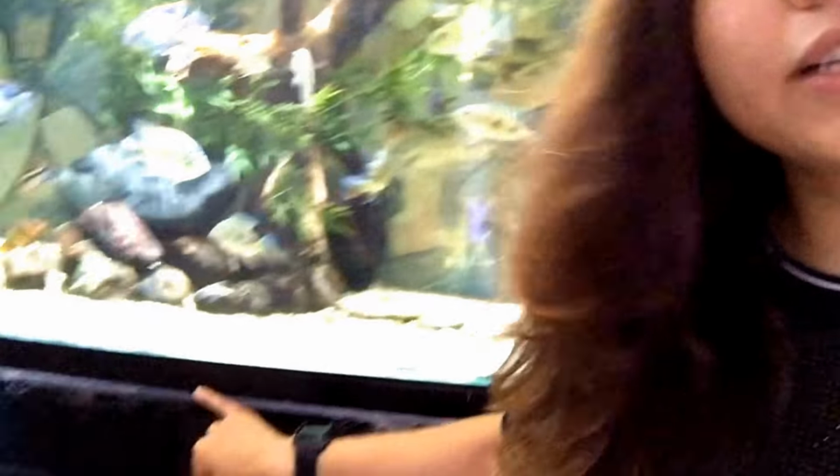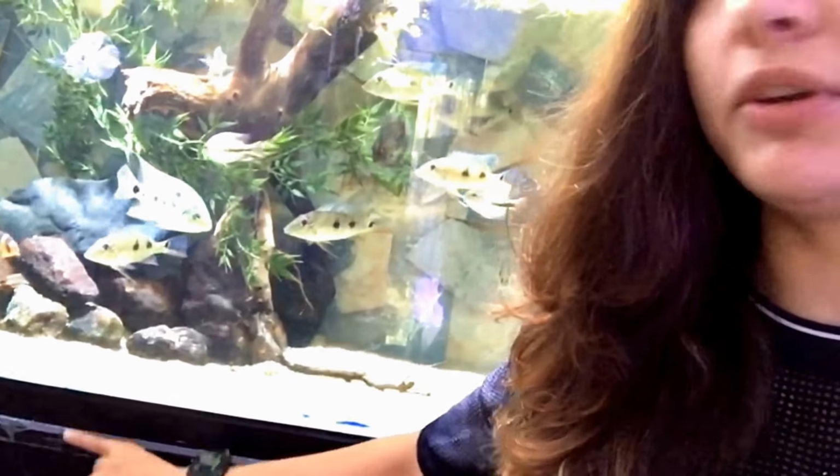Most of the wood used for aquarium stands is called melamine. I'm not sure if in English it's called melamine, but in French it's called melamine. And it's basically compressed wood chips. If water touches those compressed wood chips, it's gonna swell up your stand, render it completely like mush, and it's never gonna be good again. So prevent your stand, if it's made out of wood or chipped wood, from getting wet. You need, in all measures, to avoid water going onto your wooden stand. So always have the protective waterproof layers before it.